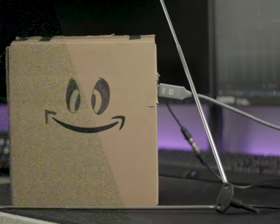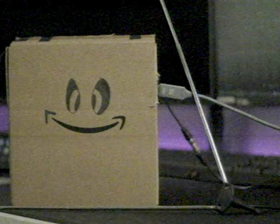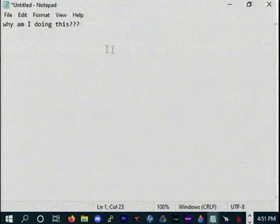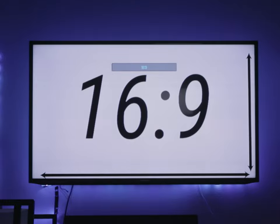Here's some comparisons between digital video and the version converted to analog. Let's run some tests through it. Right now you're seeing my camera's live feed hooked up directly to the transmitter, but that's not the only thing you can do. You can also just plug it right into your computer or any other HDMI device. What's great about this cheap HDMI adapter is that it supports basically any resolution you throw at it — it's all going to be converted to this lower quality anyway. For most of the clips you see here, I'm running a 4x3 video to the transmitter. You can actually do this with a 16x9 video too, and all you have to do is change some settings on your TV to fit the screen. Sadly, this won't give you any extra resolution because it just stretches out the 4x3 image to make it 16x9. That's why this entire video is in 4x3 — it just fits the native aspect ratio, the standard of the time. For copyright reasons, I can't show all the cool stuff I want, but I'll leave a link in the description where I tested a bunch of other copyrighted stuff. But here's some of the stuff I can show in this video.